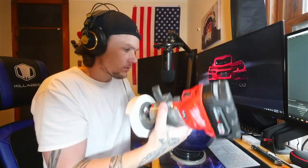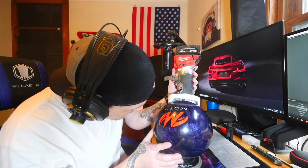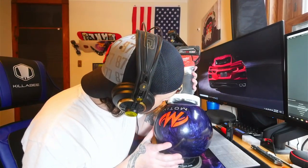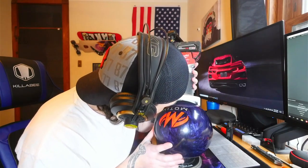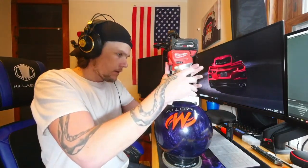So, I'll go to somewhere clean on the ball. Set the router on. And lower the bit down until it just barely touches. See, it's not touching right now, but I would rather do a pass, check it, and if I have to drop it just another hair, I'll drop it again. But I don't want to be too deep and have to fill it again.